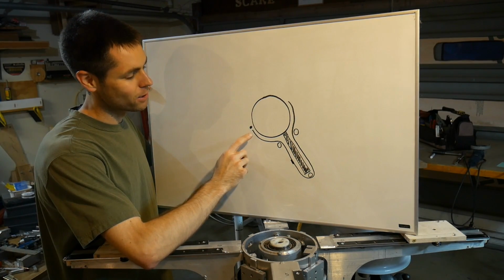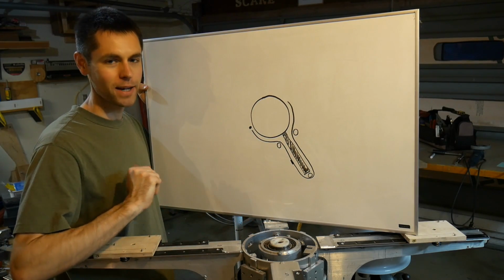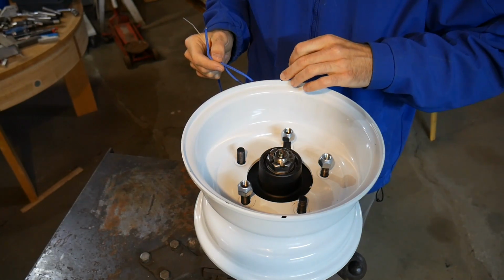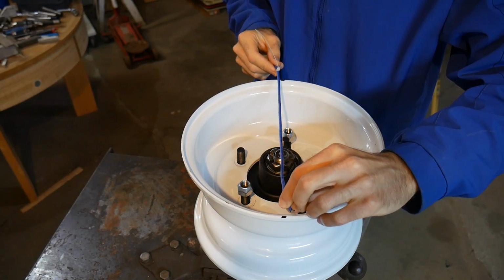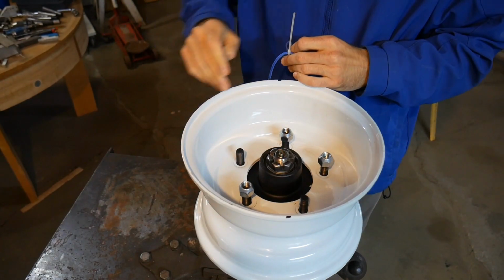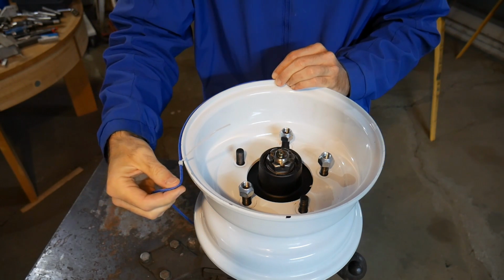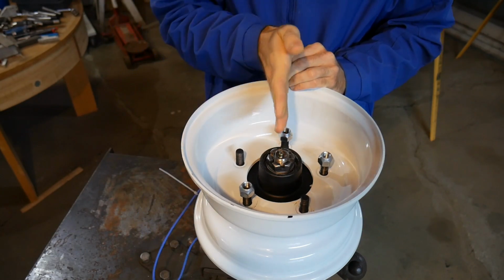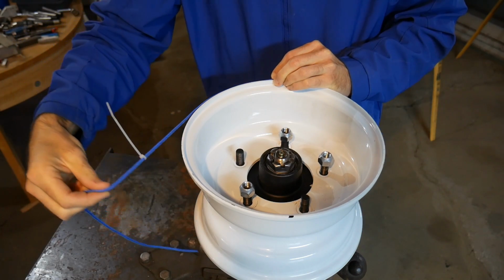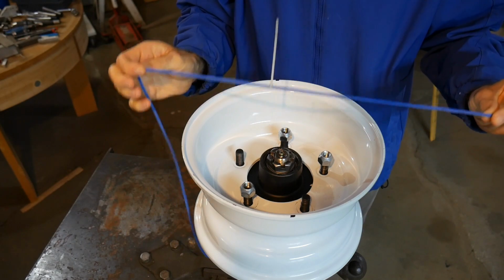And by controlling that diameter, you can control how much cable circulates and how much extension you're going to get out of your mechanism. Better yet, instead of our expansion being controlled just by the diameter of the mounting points, which gives you this much maximum expansion, this is actually controlled by the circumference because we're wrapping around it, which means that now we can get the original amount of expansion in only this much angular travel, or in the same amount we can get pi over 2 more, or 57% more travel.